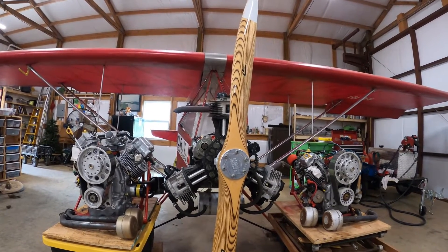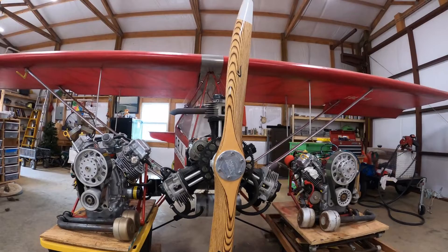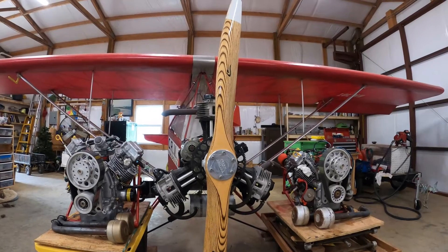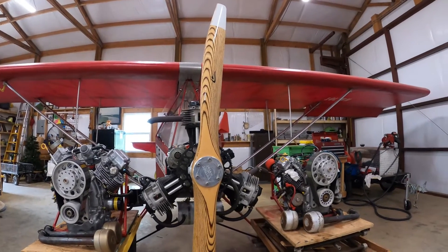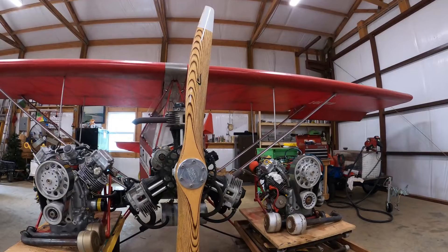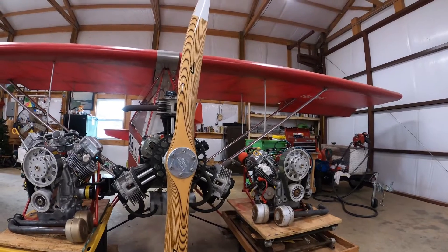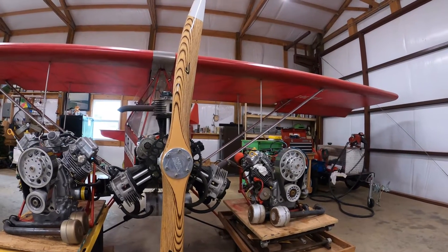If you're just wanting to buy an engine to mount on the airplane, that's kind of what you're looking at for the half VW — with magneto ignition, manual start, and a wood prop. Composite props do not work on the half VWs, and redrives do not work on the half VWs. The Verner is 2,500 maximum RPM — it doesn't need a redrive, it's direct drive. The small Briggs & Stratton needs a redrive at 1.8 to 1, and your torque goes up. The factory originals are set up for 3,600 RPM, but I'm turning this engine at max aircraft gross weight up to 4,300 and getting good, decent performance out of it.